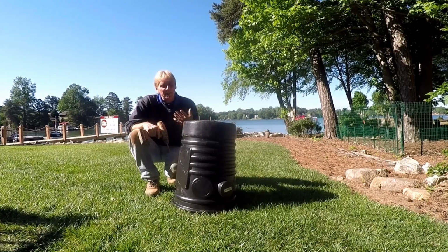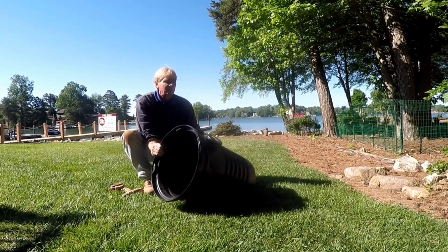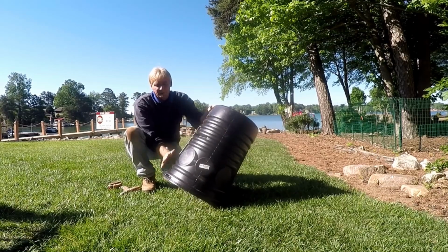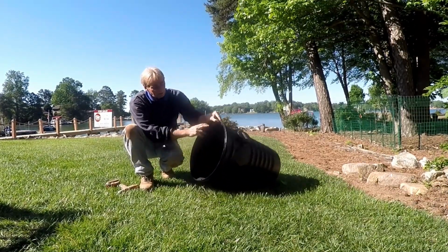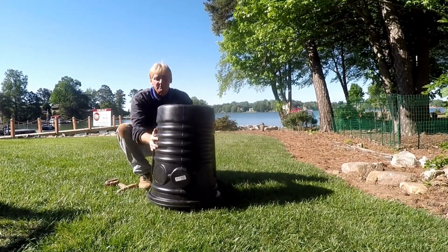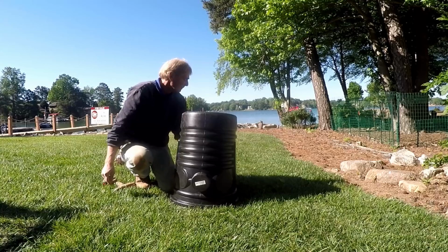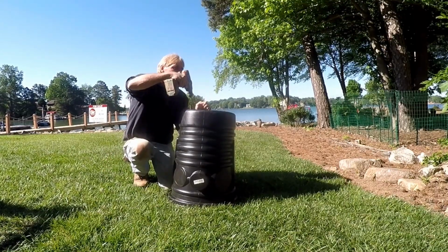So now it's time to set up our sump pit, and this is a basic pit from NDS, National Drainage Systems. It's a 24-inch pit. Actually, it's 22 or 23 inches. 24-inch opening, and it's got spots to bring in the footer tiles, the perimeter tile, footer pipe. But what we want to do is go ahead and drill some holes in the bottom.